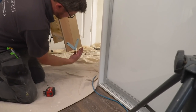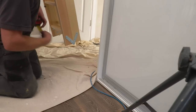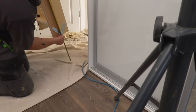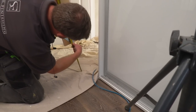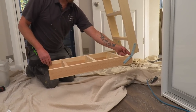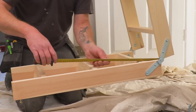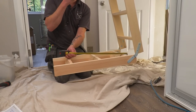So what it tells us to do, but you want to measure from the back of this piece. Right there, down to the floor, straight down to the floor. So if we keep our tape in line, the step, we've got 330. Okay, so our 330 measurement is now from here, because that joins onto the back of there. Well, not all the way, but 330 down. Right on the tread. Is it? Yes, but that's fine. We'll go to one side of the tread and adjust the top if we need to.